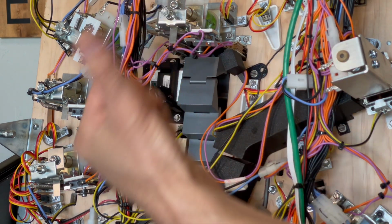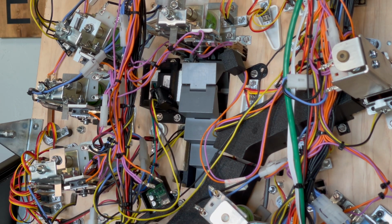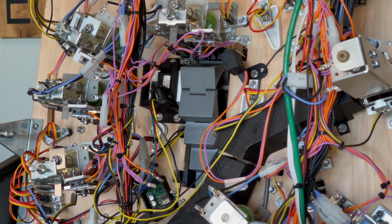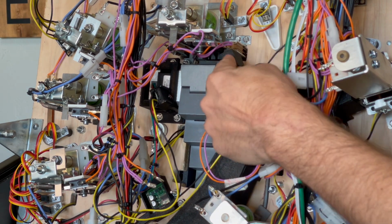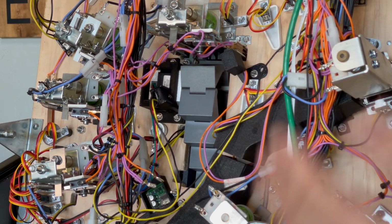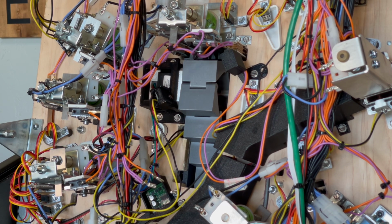So between the milliseconds it takes for the parser to go through and say, hey, this switch is now closed again, open, however you want to look at it, right? It's changed state. This beam is now connected again. And then how long it takes for the motor to decelerate and the software to tell it to stop moving and all that, it would move just a little bit past it. So I got it to where the beam is open just before it gets clear, probably 4 or 5 steps early. So by the time it stops, it is stopped in the right place, okay? All right.